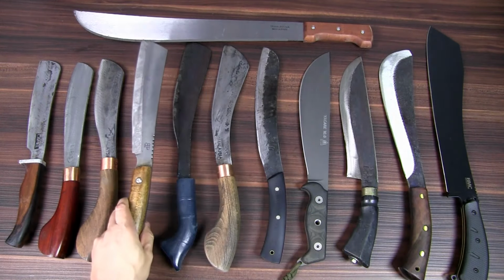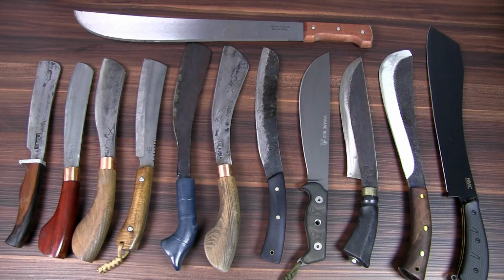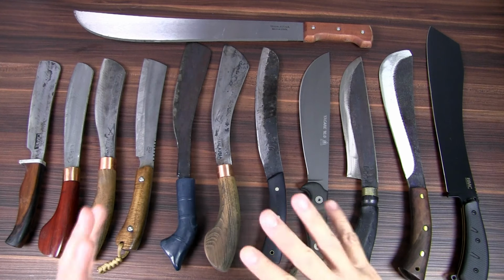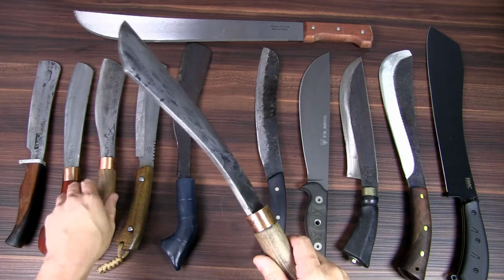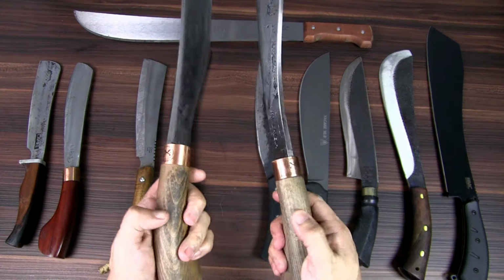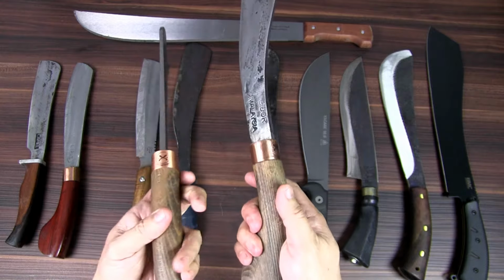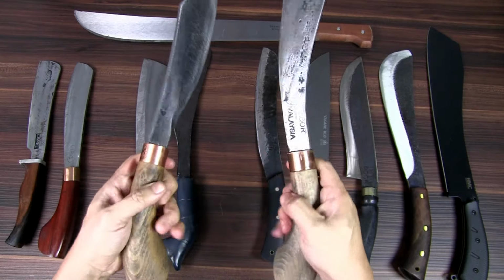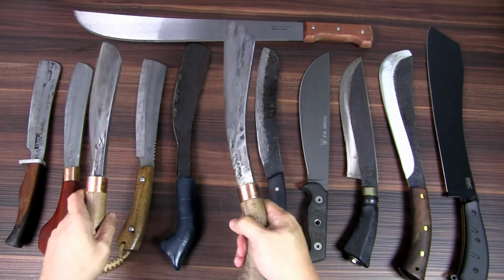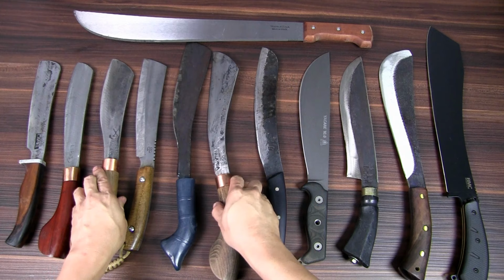So that's the thing about some wood knives. If you do full tang, sometimes the wood can shrink and then it gets misaligned with the tang. Something like this, which is from my parang, they do a great rat tail style blade. So that means the tang is inside and it's not a full tang, but the handle becomes very comfortable and it will never go out of shape, so to speak.